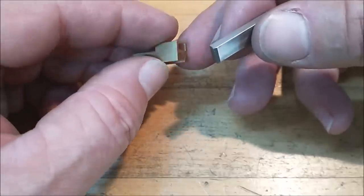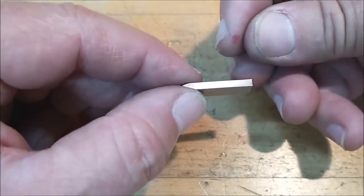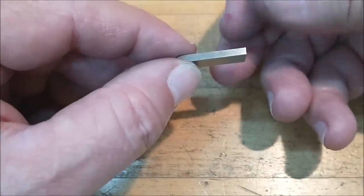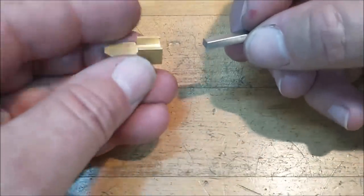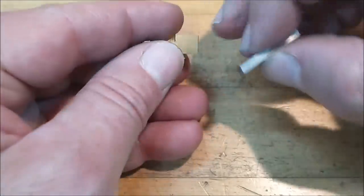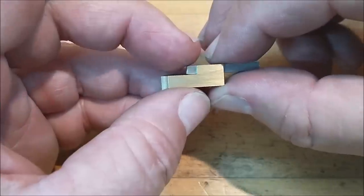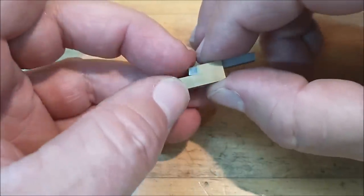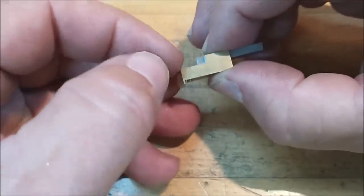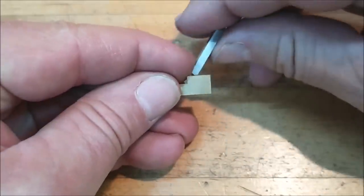The tool slide you just saw me do in a previous video. That's not a cut — that's red marker. When I make really small parts I might put a Sharpie marker on them, turn them red, so they stick out like a sore thumb on the floor or in the chip bin. Now this guy has to have holes in it here and holes in it here, and they have to go together perfectly. There's no better way to assure that than to do them at the same time — I'm going to squeeze it like this, drill a hole all the way through, then adjust the back surface and back corner so that it swings freely.